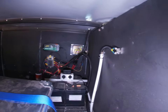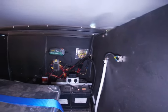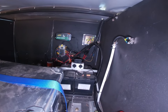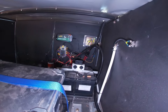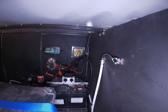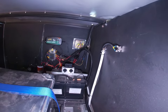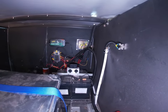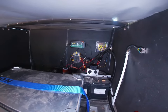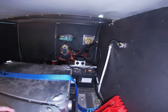Over here on the side you can see the plumbing going up toward the hose bib. In the back you've got two deep-cycle batteries — 200 amp hours of power supply — plus a couple of 12-volt outlets and several USB outlets. Up here on the upper right is the solar controller connected to those two external connections and the 50-watt panel through the top. There's also a shore power charger — just a 5-amp, not huge — along with junction blocks and a fuse block.